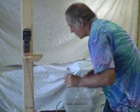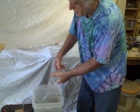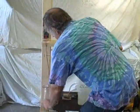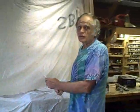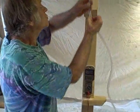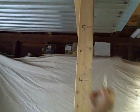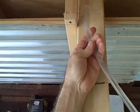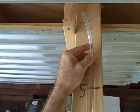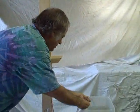The next point we want to measure is the head pressure — the next most important thing as far as the pump is concerned. We just want to see how high the water will pump. The column of water is up to about 5 feet 5 inches. That's our head pressure.